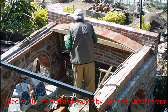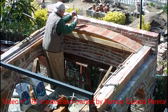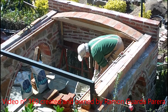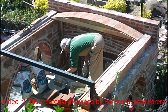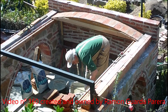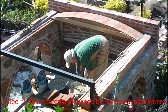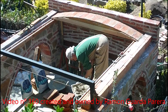Before continuing with the first layer, I will start the second layer, trying not to match the joints with those of the first layer. To avoid it, I'll start from the wall with half pieces of bricks of 3.3 cm thickness — 28 × 13.5 × 3.3 cm, called 'mao' in Catalan. This first row of the second layer will be placed with fast-setting cement mortar at a proportion of one to one — one part cement and one part sand. It can also be done with other materials, but if there is a hurry and you want to remove the formwork faster, this method is safer.